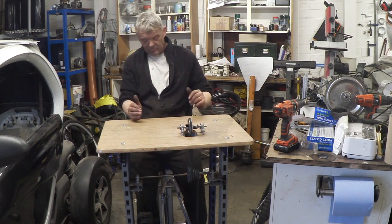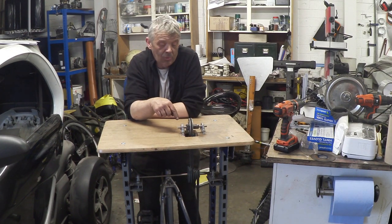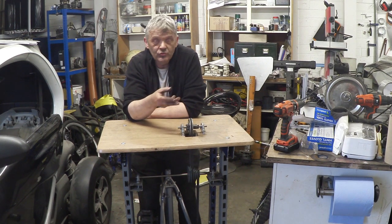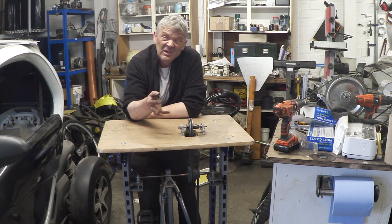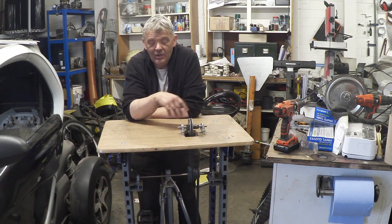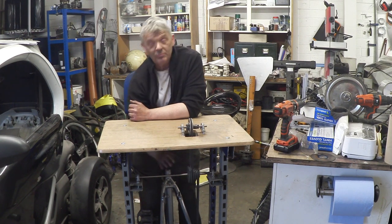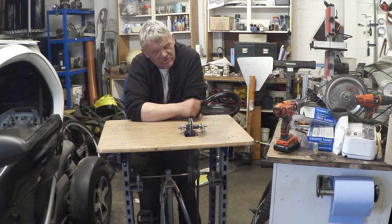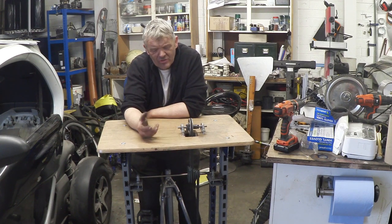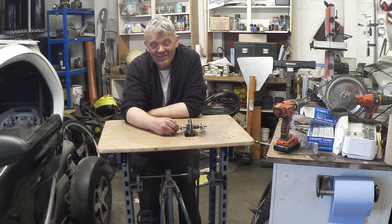Now there's no flywheel on this thing, but we could add a flywheel if we wanted. Remember, there are three points at which this energy comes off. The bottom point in the axle is a one-to-one ratio, and you might want to stick a generator on there — one of those lovely washing machine motors, one of the new brushless ones, would be a great place for a generator. There's a pulley block right here just underneath where you could take off and run other bits and pieces. And this one here we can use to run small machines at worktop height — things like a grinder, for instance.